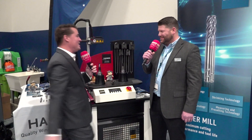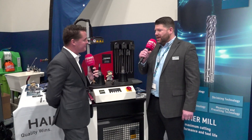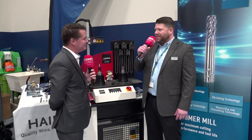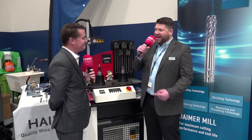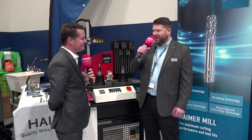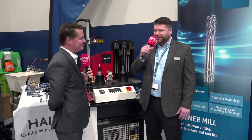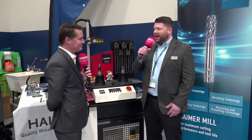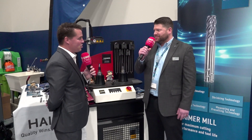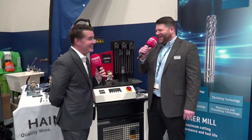This is what you get when you talk to an apps guy that's moved to sales. Rob, thank you very much. We are going to move on with one last question: when it comes to yourself and Haimer, what does the relationship of Morris Midwest mean to you as we're standing here at their open house today? I'm very thankful for it and I like working with them. We actually have a couple of our shrink fit tools on the 5-axis machine right behind you — we've got one called our Power Shrink Chuck for the roughing operations, and then we've got our Power Mini Shrink that has the slim nose for the finishing application, which is really beneficial because it can get into tighter areas for that kind of finishing or milling operation.